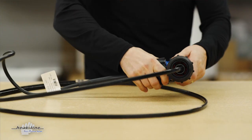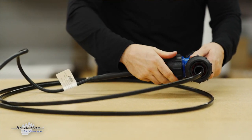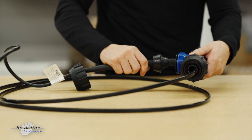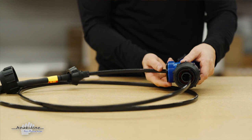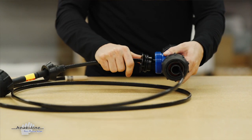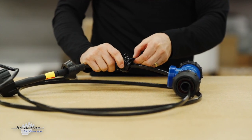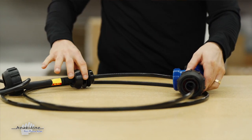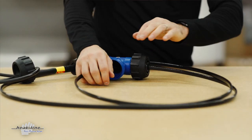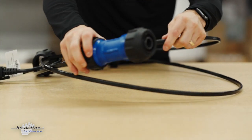All you have to do is disconnect where the heating cable enters into the T, pop out the entry seat where the compression grommet sits into in the T, and then you have to feed the T off of the entire length of the heating cable. For shorter units it's much simpler — obviously not as much length to feed the T off of.